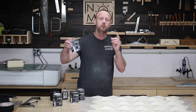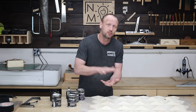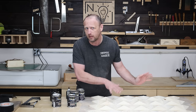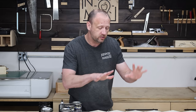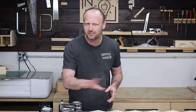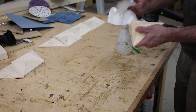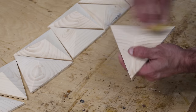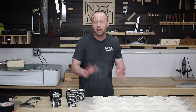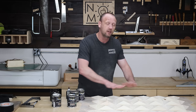As far as the stain goes, I'm going to use some General Finishes water-based stain — not sponsored, I just like this stuff. They dry super fast, so in a couple hours this should be dry and I can apply a top coat. A downside is that since it's water-based, it's going to raise the grain when applied to the wood. The easy fix is to squirt it with a little water, let it dry, then lightly sand with 220 grit to knock those grains back down. Now when I apply the finish, it won't raise the grain again and it'll stay super smooth.